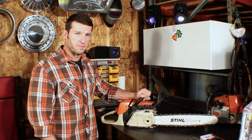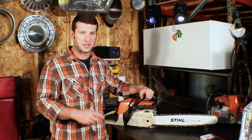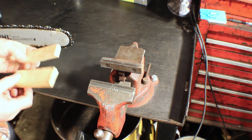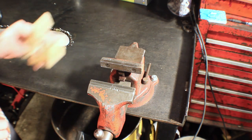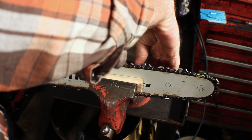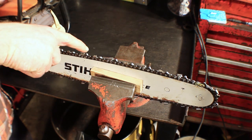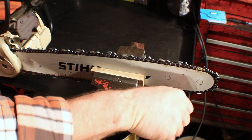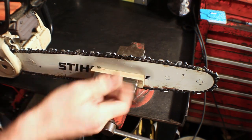For sharpening you don't really have to have a stump vise or a shop vise — you can do it on a tailgate or even on the ground. But it's often preferred if you do have a vise to stick your machine in it. My vise here in the shop is actually a little too small, so I'll show you my solution: I've taken a piece of wood and snapped it in half so I have two pieces, one for either side. You stick a block on one side, angle your bar so you've got pressure points on both pieces of wood, then tighten up. Make sure your chain's not resting on the bottom. This is solid steel — don't be afraid to snug it down.